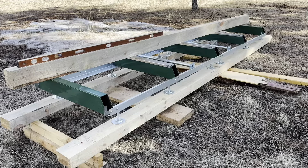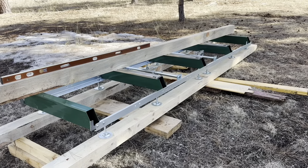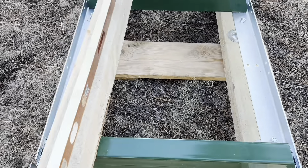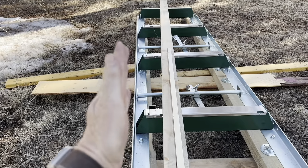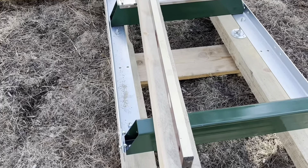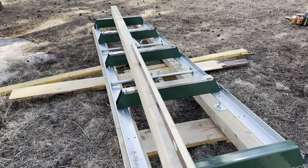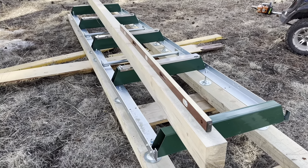I have a new respect for how difficult it is to move this track. The width from rail edge to rail edge is 37 inches, and I've got to maintain that 37 inches all the way down the length and ensure the rails are parallel and not bowed. Then once that's done you measure the diagonals — from corner to corner — and if it's not square you have to jog everything to get it right. Tons of time and frustration getting to this point, but we got there.